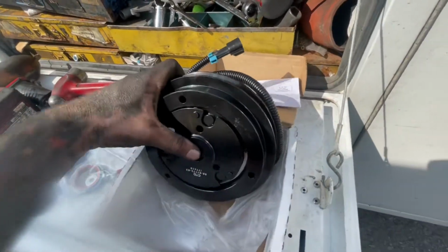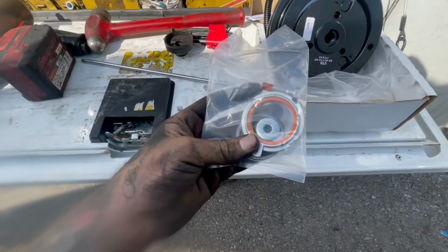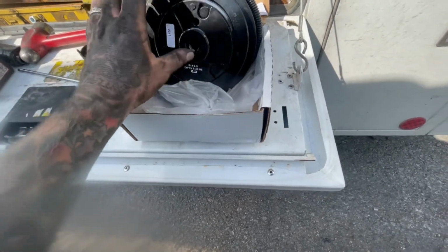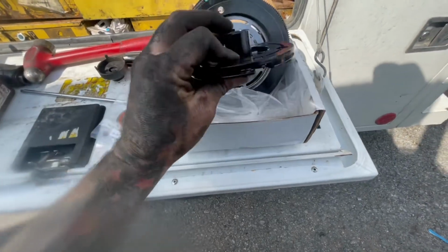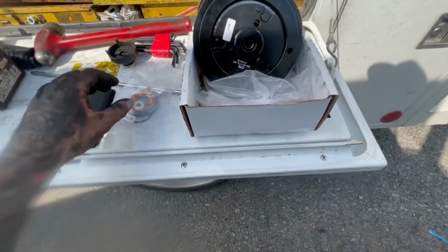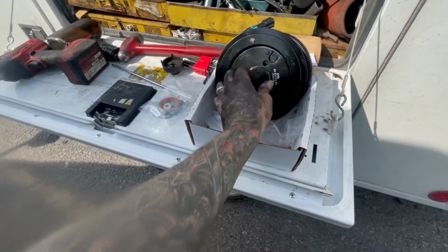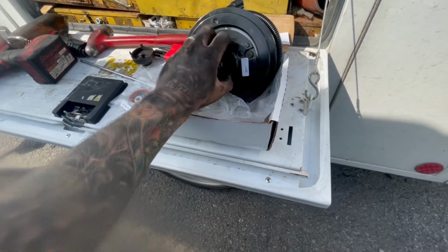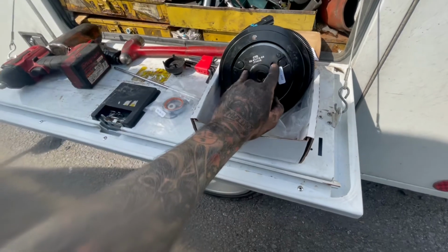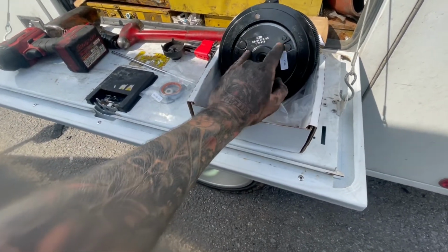Now here's how this thing goes together, just like this. There is a lock nut, and it comes with a new one and all that good stuff that goes through all this, and most of that's on the inside. But right now we want to get this piece off right here. It's still attached up there. Whenever you take the bolt through it out, it's left-hand thread, so you want to remember that. This thing is going to spin, so you've got to grab something in there. Some people make a tool for it that fits in here and locks it, so that way you can turn the bolt.